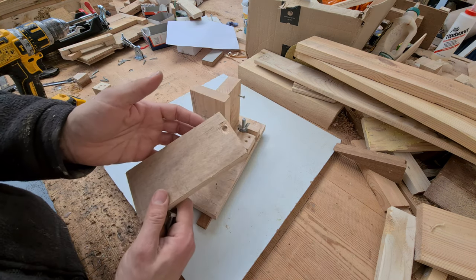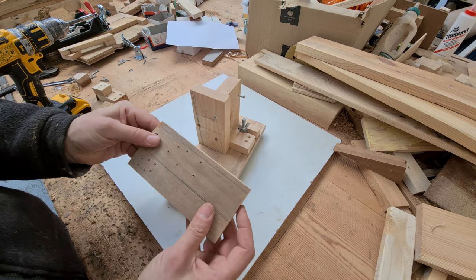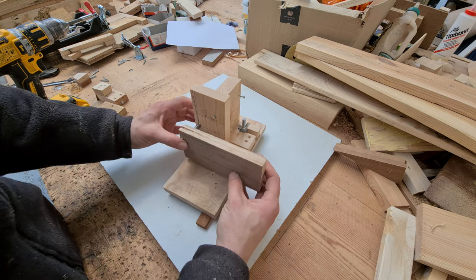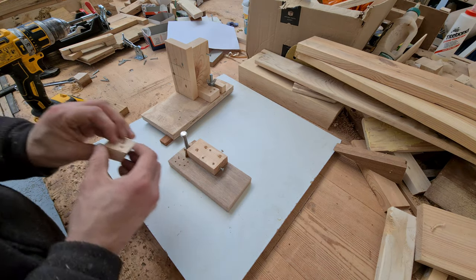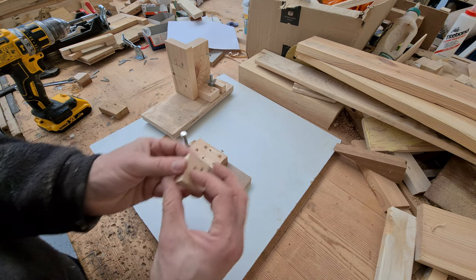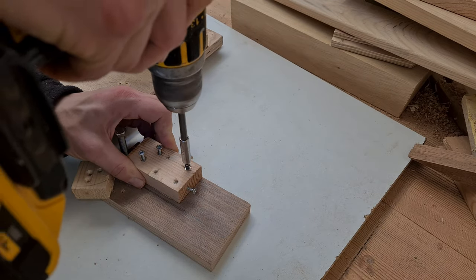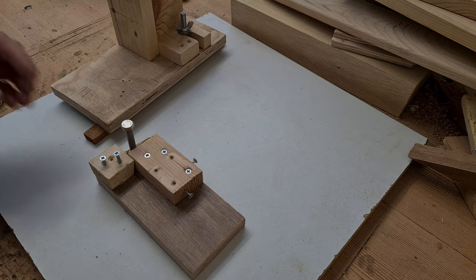To the second upright, a small piece of plywood is attached through a single bolt which provides the rotation axis, and it's going to be this piece that holds the segments. A stop piece and a segment rest are attached to the rotation platform. The rest piece is profiled to the mitre angle used to bring the segments into a ring, and it's vitally important that the positioning of these two elements places the center of each segment directly over the rotation center — namely the bolt.